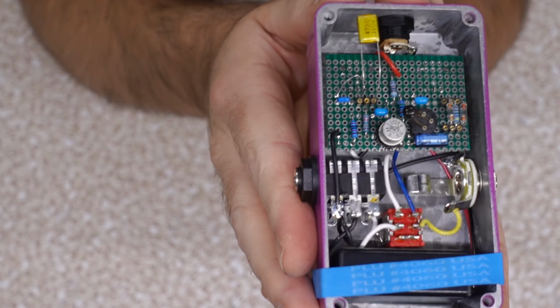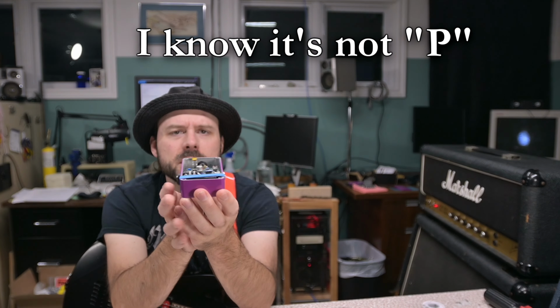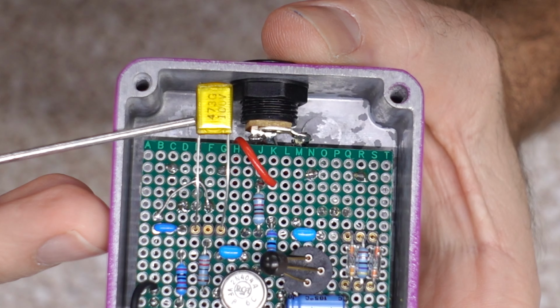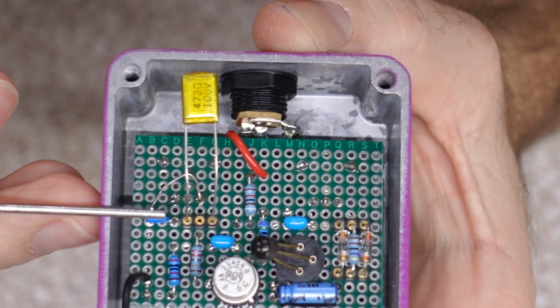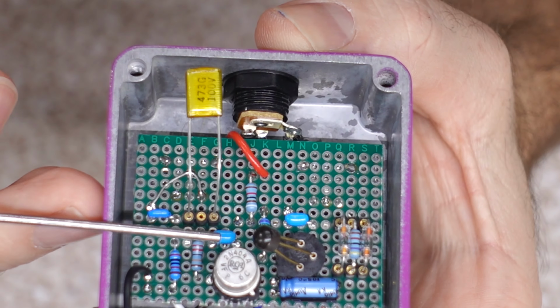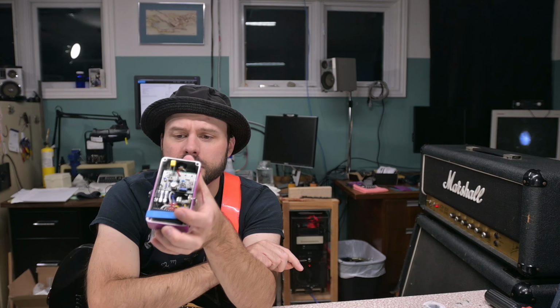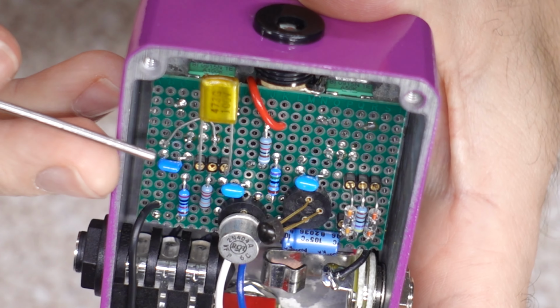In my pedal, well, you're gonna notice the PCB is different, but that has nothing to do with tone. I just got new PCBs in stock and wanted to use it for this project. So there's our 47nF green cap, which is yellow often. There's our 100pF, and there's our 0.1uFs. And what are those? They're ceramic capacitors. We're gonna be using ceramics for the 0.1s. That's not a mica anymore. That's also ceramic. They could be Murata or TDK. I know the 0.1s are Murata.